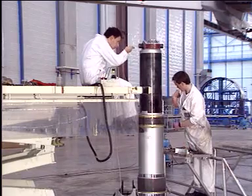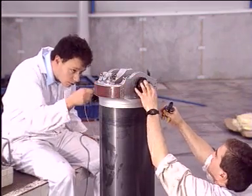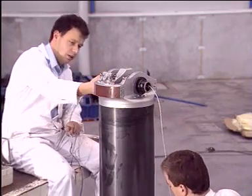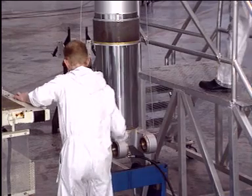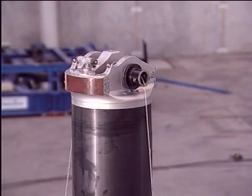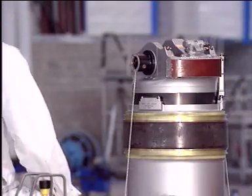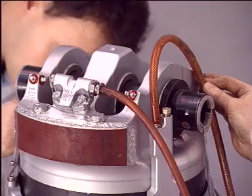Now install the appropriate winch tool on the shock strut jig. Fit the hollow pin at SM9, then pass the cable through the hollow pin and secure it on the shock strut jig opposite the winch. Progressively tighten the winch in order to completely compress the shock absorber until it bottoms. Ensure that the filling and bleed valves located at the top of the piston are open.